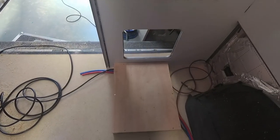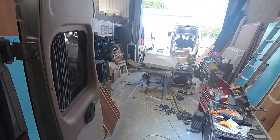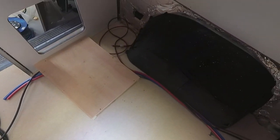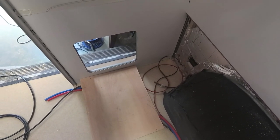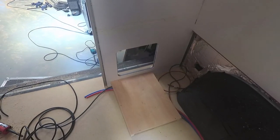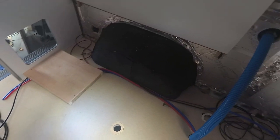The toilet door's all cut in as well. That's a pedestal to go underneath - you can just about see it underneath the shower tray. The waste hole is in there, and that's the plumbing that's got to come round, so I've routed it underneath the base. There's a gap down this side on the shower tray. The wire there is for the toilet electric flush. The black wire there is a 240V feed that's got to come round and that's the best way of doing it. I'll Sikaflex this floor in and maybe put the other two walls in, then video again.